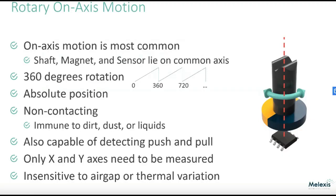For example, take a potentiometer — a very common electronic component. The way that works is you have around a 270-degree curve of resistive material with a wiper and contacts on either side. You physically drag the wiper across the resistive material to create different resistances, which is great, except that anyone with an old stereo knows that after a couple of decades, the volume knob gets worn out from the mechanical rubbing.